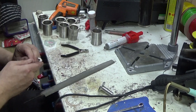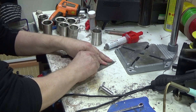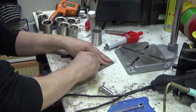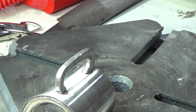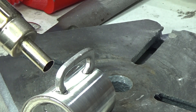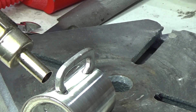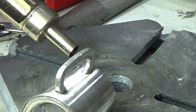The handle needs a little bit of work to suit the angles and curvature of the outside of the pot. I file it in an inverted way, holding the file stationary and sliding the handle on top of the file. Now it can be soldered on with more low melting point solder, and that's basically it — a finished pot. Just some fettling, cleaning, polishing, et cetera.